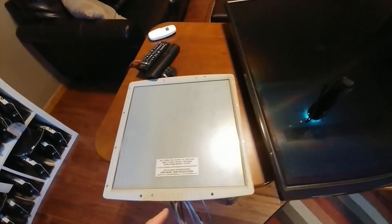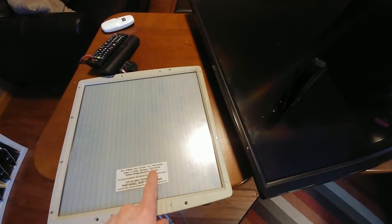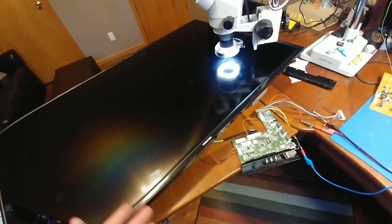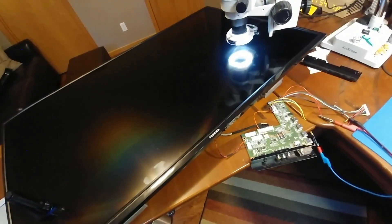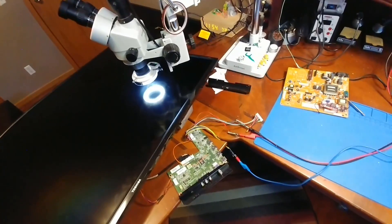Unfortunately, the solar panel I was planning on using is not going to be enough. This maxes out at about 320 milliamps. And right now we don't even have the speakers hooked up — there's no audio. Sound is going to need a little bit of energy. So I'm going to need at least a half-amp solar panel to run this.